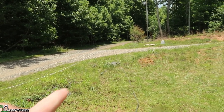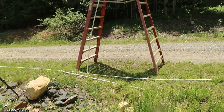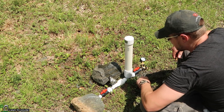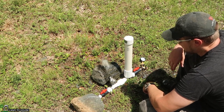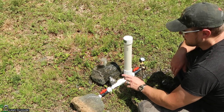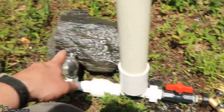I think it'll stop here in just a second because I'm about even with the bucket here. Let's see if that's going to stop us. Let's continue the test here and see what we get. This portion of the test may be a little bit weird, but we'll give it a try anyway. I'm going to go ahead and get this cycling. I got 23 cycles — a significant increase in the cycle time by doing this. And pressure is at 84 PSI. Significant increase in pressure and significant increase in cycle time.